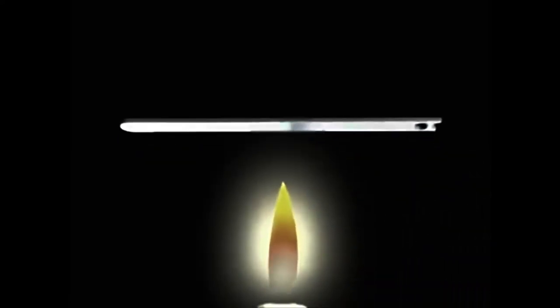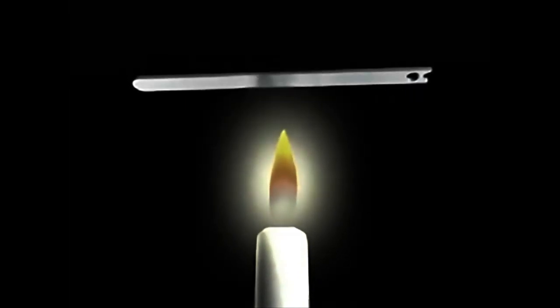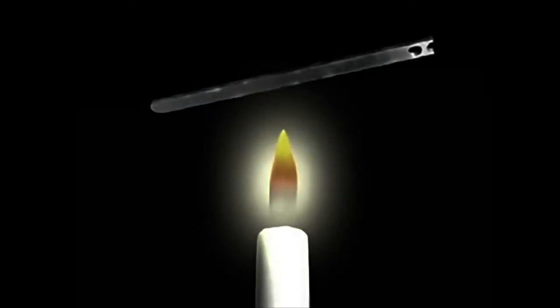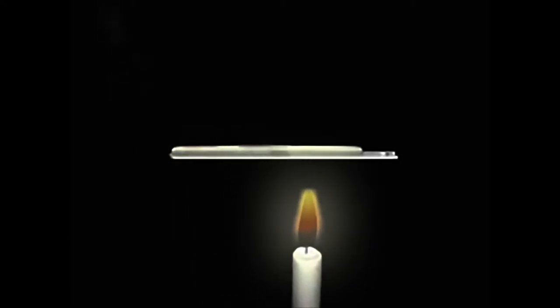You will need to put a coating on the blank that can easily be scratched off or marked on. A common way to achieve this coating is to hold the blank above a candle flame. The soot that rises in the smoke will cover the blank with a thin black coating, which can easily be scratched off. Another method is to use a candle to melt some wax and coat the blank with an even layer — getting just the right thickness will take practice. You can also use a marker, tape, or anything else which will let you see the impression marks. When you are satisfied with your coating, you can begin impressioning.